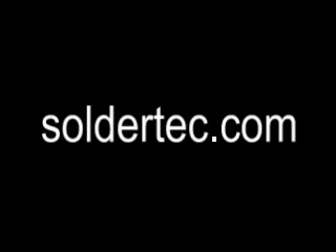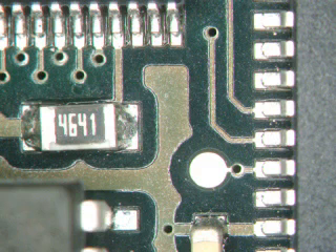We've just received a printed circuit board for solder joint evaluation and we're looking at it under the optical microscope. We can see pretty much all the solder joints on here to make that evaluation. There is one particular component — the ball grid array or BGA component — where the solder joints are actually located beneath the component, and for this we need to resort to X-ray inspection.